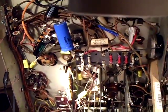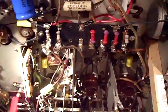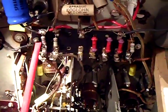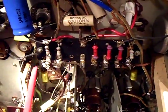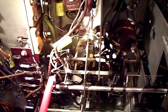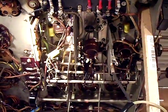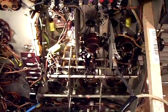I got the radio back together and I replaced this resistor here — that's the 1k resistor, the one that had burnt up. I cleaned out that space I previously mentioned inside of the switch here, and I got everything hooked up to the test bench. The radio has been running about a half hour, warming up.